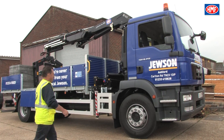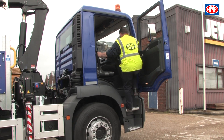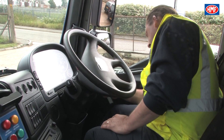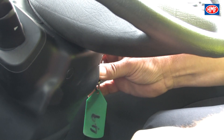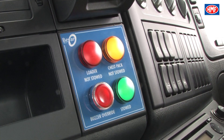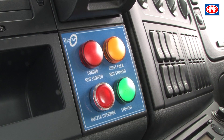Welcome to the EVS setup guide to help get the most out of your HMF crane. Upon entering the vehicle, check the gearbox is in neutral, start the engine and press the clutch. Wait 4 seconds, then engage the PTO. It can be located to the right-hand side of the blue crane control panel in the centre of the vehicle dashboard.